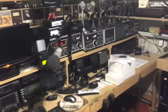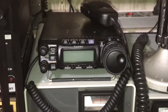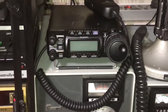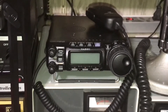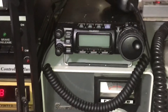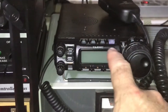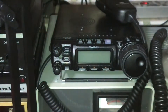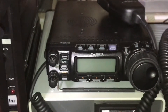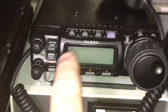This is a final video clip for the Yaesu FT-857D. We replaced the LCD display with a new control panel — that was $177 from Yaesu. Re-installing the control panel back in is a little bit more difficult than pulling it out. Behind the bezel where the LCD panel sits is a foam gasket — very thin, goes around the edge. On this particular control panel, that foam was all dried up, goopy, and when I was fitting the control panel in it got all around the glass.